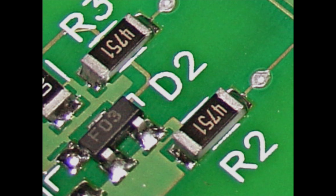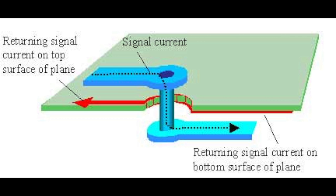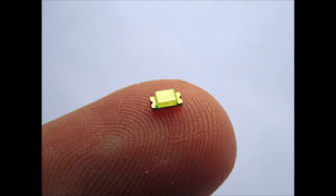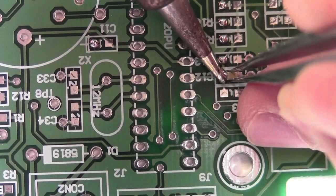The vias run between the two sides and connect different parts of the board. Vias are nice because you can put your wire through the via and solder it — it's a lot easier to work with than surface mount technology, which is very tiny and hard to solder.